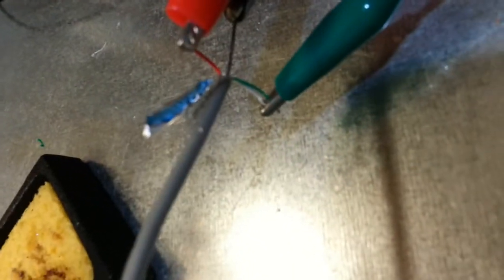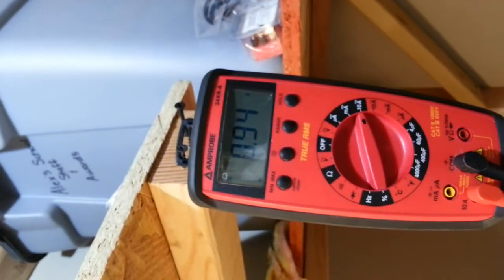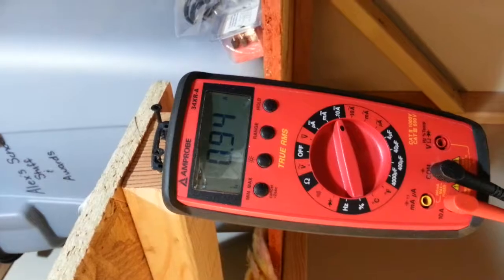We might have some limitation as far as the thickness of the wires, but I kind of doubt that — 2 amps should be pretty easy to pull through this. So if you want to make a charging cable, just short those two wires together, and that'll tell the device to go ahead and pull as hard as it wants or as hard as it thinks it needs to.